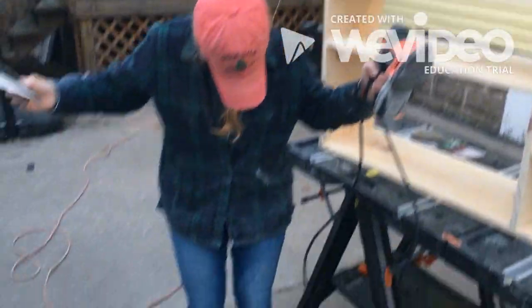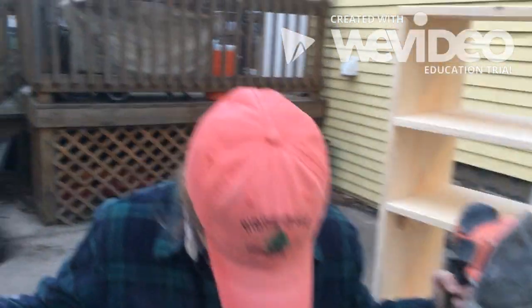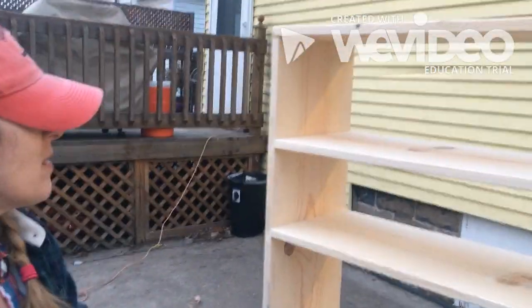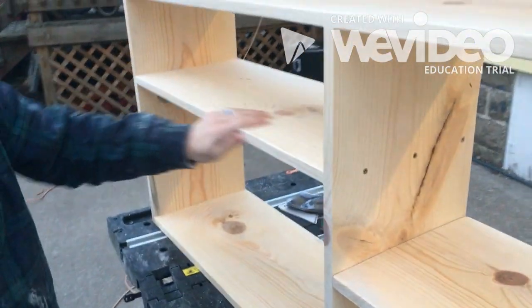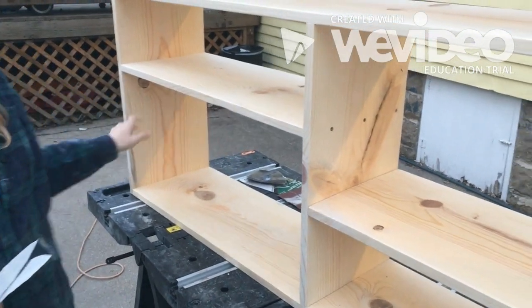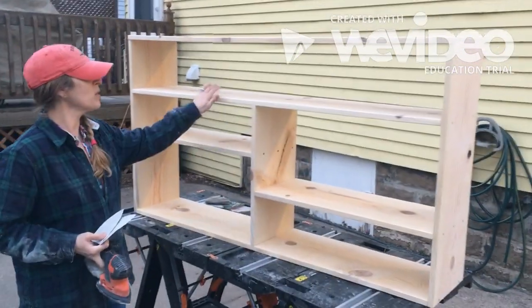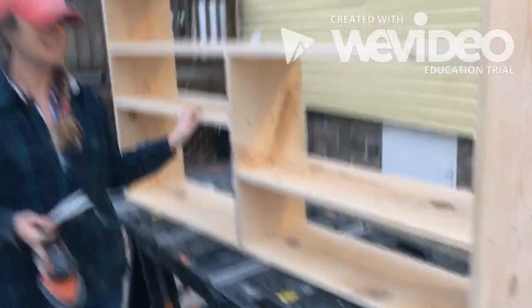Okay, I'm done. This is 4 pads of the mouse sander worth of dust. Oh yeah. I have to admit, I brush some of it off, but it's sanded. You can see it needs to be dusted before we stain it. It still has lots of dust on it, but the color's a lot different than it was before we sanded it, which will make the stain more even. No more numbers, no more math, pencil marks. It's ready to stain.